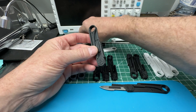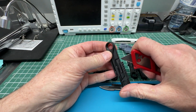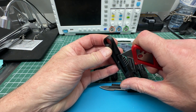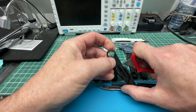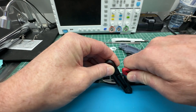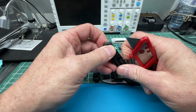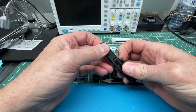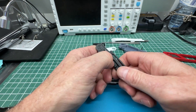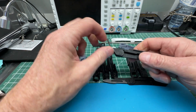So with matte filament you can get it to open at about 0.35 on the smallest clearance. Once it comes off the build plate it'll feel locked, but it will separate if you're careful. First, get something into the back end of the mount — you might break a few trying this, so hopefully this video helps. Once you get that started you can lift up the back end and separate a lot of where it's fused together, then pull hard and it'll rotate free.